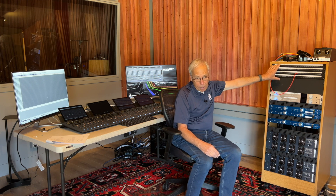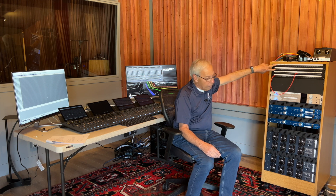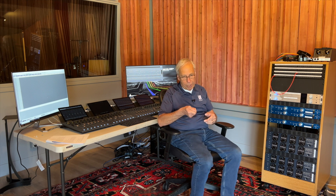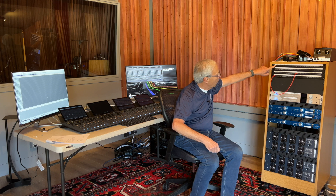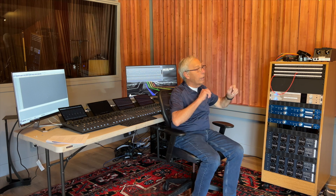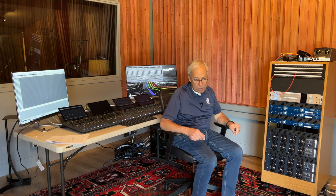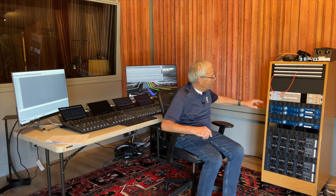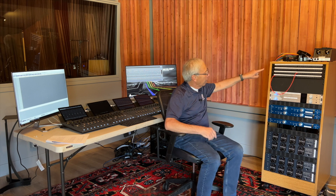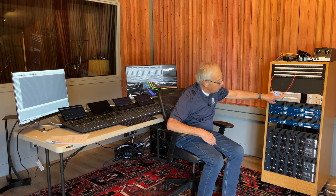Here's your standard patch bay — if you just leave these alone, they'll connect the top to the bottom. In a later video I'll show you we have these big XLR patch bays, an XLR input stage where you plug a microphone in. It goes over into the studio, or we can send it to the ISO rooms, the mix room, or the reverb. There's hundreds and hundreds of feet of cable in this room. The simple chain is the microphones — all hooked up with XLR connectors — go into a junction box, come over here, and go into the A to D converters.